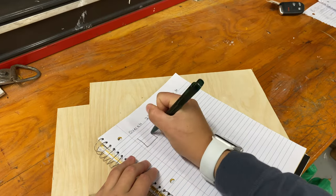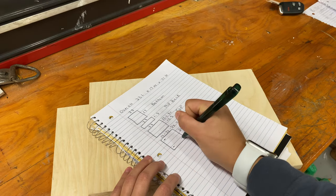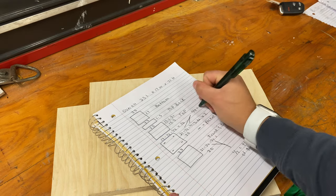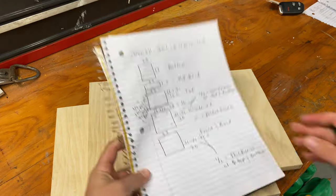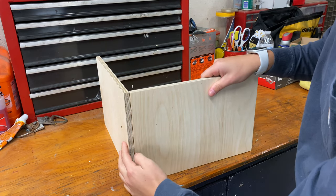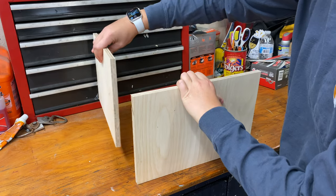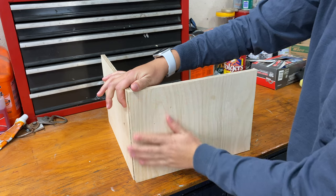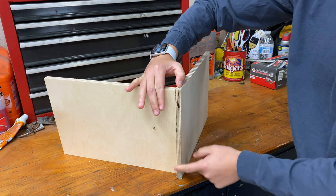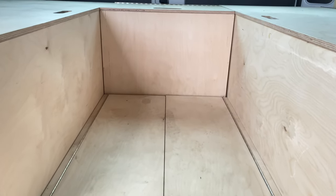When finalizing measurements I found it easiest to start with the box's overall dimensions then break it down to each individual piece. Remember to subtract the thickness of the top and bottom of the box from the height of the side boards, and the same concept for the side pieces — take into account the thickness of the front and back boards and subtract that from the side dimensions. Also consider how you plan to piece each box together for the cleanest finished look. You could also purchase edging that you can iron on for any visible ends, which will give it a more finished appearance.